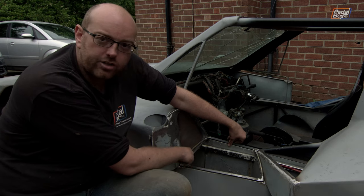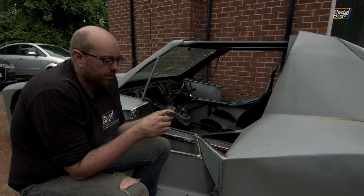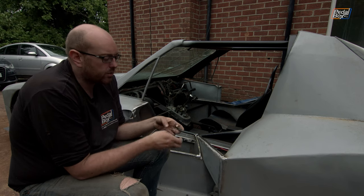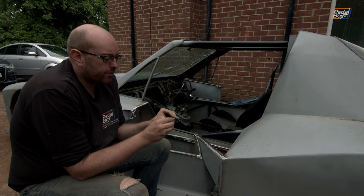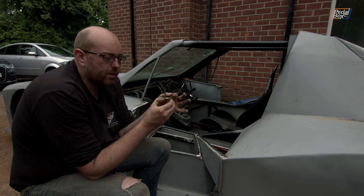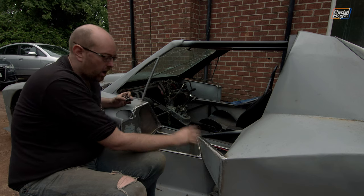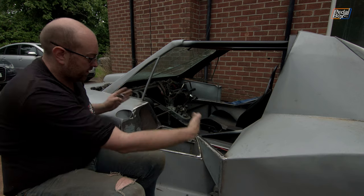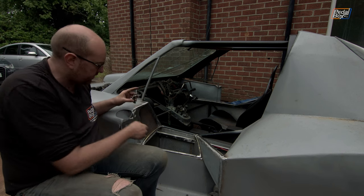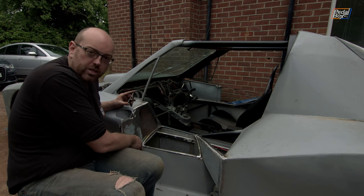I've started making up a couple of little bits of hinge whilst it was raining earlier on. This is the hinge I've been playing around with today - it's made of some 3mm plates and 10mm tube and an M5 rivnut. The rivnut's outside diameter for the hole you need to compress it into is 7mm, and the inside diameter of this tube is 7mm, so that makes it extremely convenient. The bolt isn't actually perpendicular to the mounting plate because it needs to be in line with the bottom edge of the door, and the frame panels are at slightly different angles. I'm going to test whether this mechanism actually works because if this edge clashes with the bottom edge of the bodywork, it's a no-go.